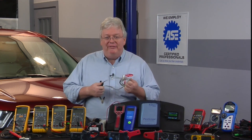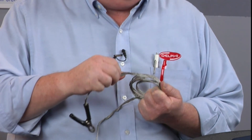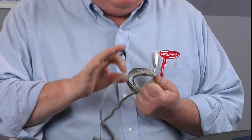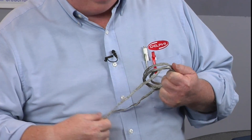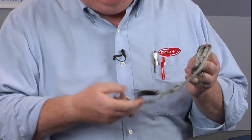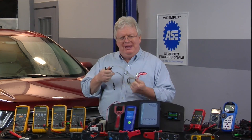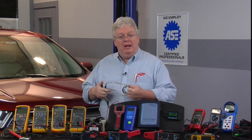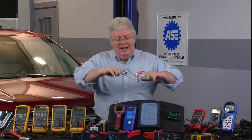As far as shielding the circuit, a braided ground strap is very effective. The braid gives the electrons going through the air — the RFI, radio frequency interference — a place to jump onto, like a landing deck of an aircraft carrier, and go to ground. My little test braided ground strap has got good, clean, tight alligator clips. I'll use as short a piece of ground strap as possible, and tie it between, let's say, the hood and the cowling, like a lot of police cars use for their telecommunication EMI/RFI problems. Braided ground straps are helpful.